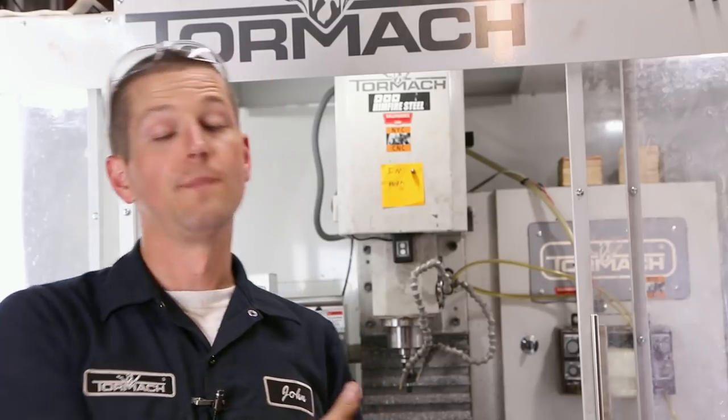Yes, I backed my feeds and speeds down a little, but I did go ahead and do a full retract, and man, that crushed my cycle time. That really made this slower. Not a big deal. We're not making these for sale or for profit, but it matters. So something I now need to do is go work on that. I got to get smart. I have a great recipe for the larger, the 7/16, half inch drills. You saw that. I need to get that recipe nailed down for the quarter inch and drills around that size so that we can bang through those quicker, not have them chip load and have them last.